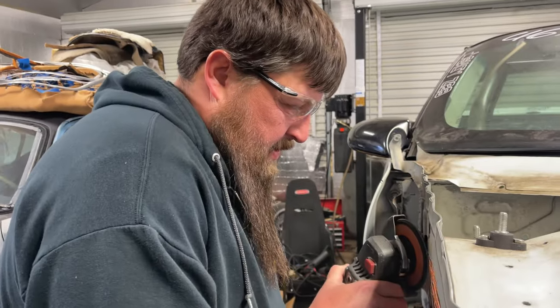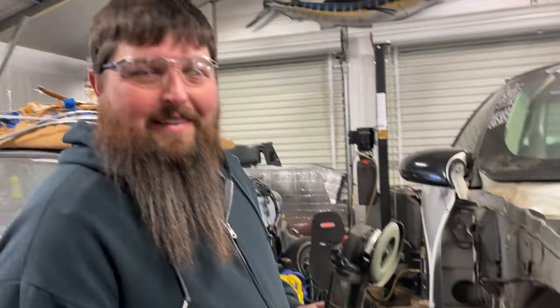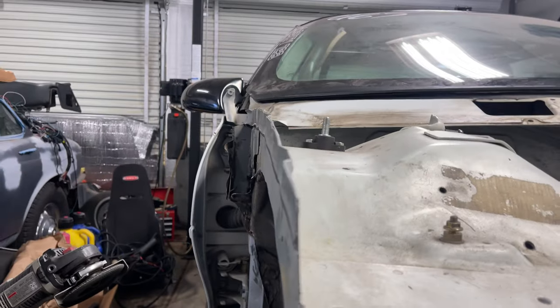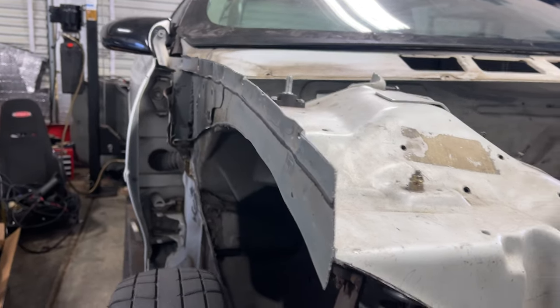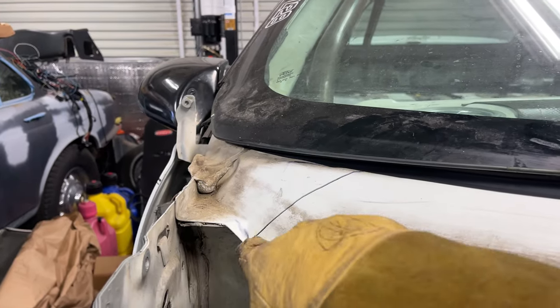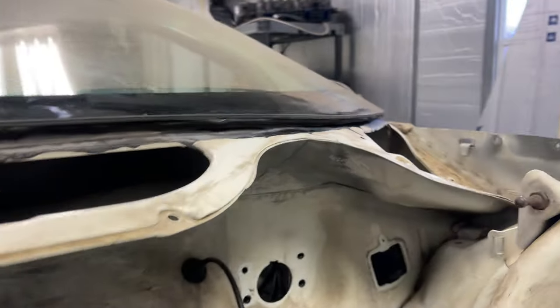Battery working better today? A little bit — for now. That thing was dying quick yesterday. We're just taking this lip down here to get a nice smooth edge — there's a double edge here, kind of hard to see, but we're knocking that down until it's hopefully pretty smooth. Might take a hammer and roll this edge too, but you won't see any of that once the fenders are on. The plan of attack is cut up here, bring it into the windshield, cut along the windshield, taper it in there, bring it down, and cut across that seam the whole way.